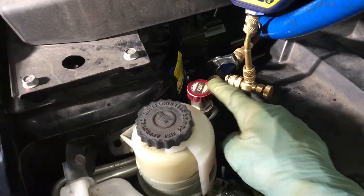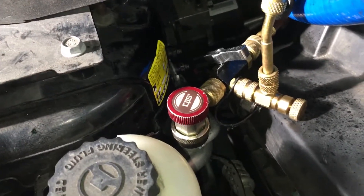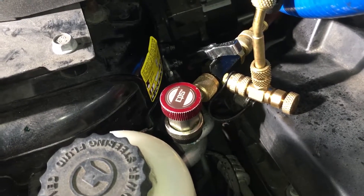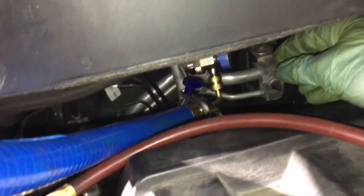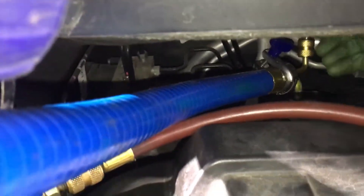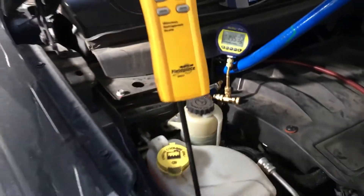I have that on and this depressed. You don't want to put refrigerant back up your vacuum pump, so I just backed off — I'm backing off the valve back here. Now when I put refrigerant in, it won't back up.